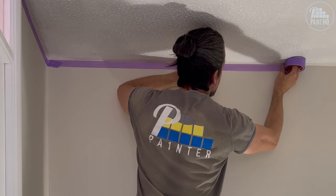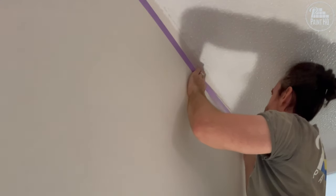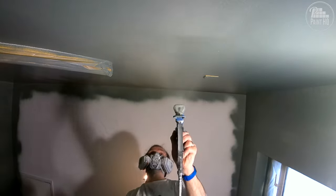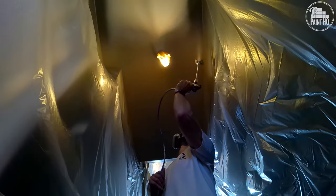First up, sensitive tape for sensitive delicate surfaces. You want just enough adhesion to stick and not fall off, but not too much that paint would pull — or worse still, pull wallpaper. I use KIP WashiTek 209 Purple Washi Tape, rated at 0.8 Newtons of force over 10mm. I'll mask walls coated the previous day, masking the ceiling cut line in conjunction with KIP MaskingTek 232 — a 2.6m drop of plastic film — before spraying the ceiling, which is usually the last day of a project.